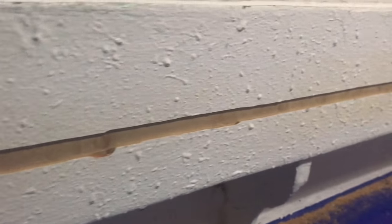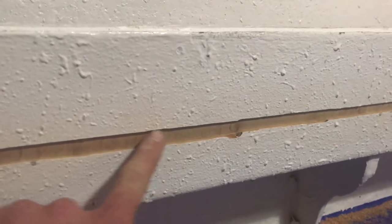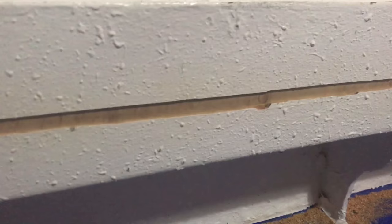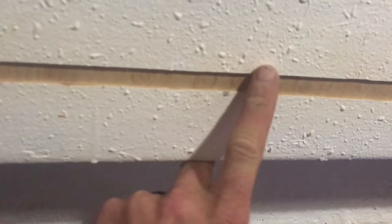I've got my little groove where I'm going to stick the LED strips in. It's got an adhesive back so I'm going to stick it on with that, but that 3M sticky tape is not very sticky and it's not going to last very long, so I'm going to use some clear silicone as well and then have it covered off and make it flush and nice.